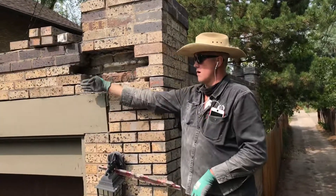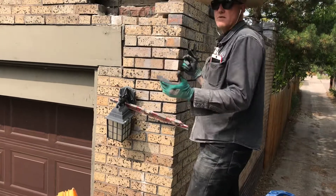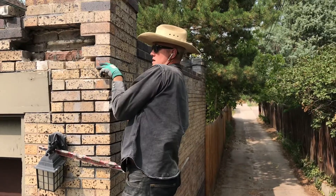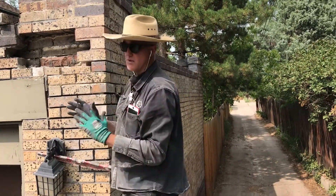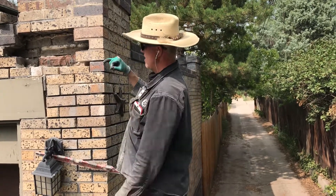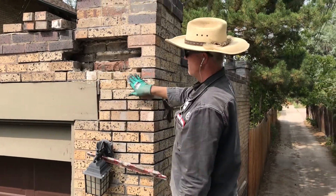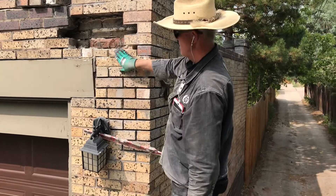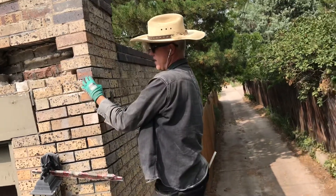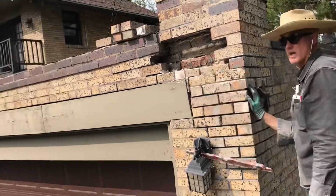This part we've got these bricks that are on the line — they're actually overhanging this piece of wood. What I'm having to do at this point is pull my bricks back to the corner because I just don't have any other choices with how this thing's twisted up. And then we've got elevation issues — from here to this brick here, this point to this point, we're really, really high. I had to take full-size bricks and actually cut them down, and then I'm going to have to lay them in to cheat them and probably make a fake joint here on this side to make that not stand out so much.